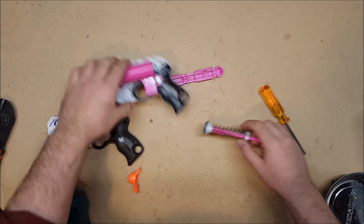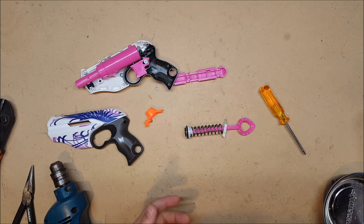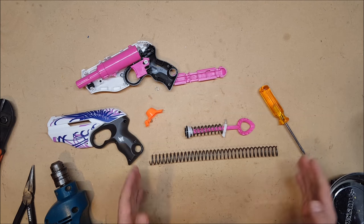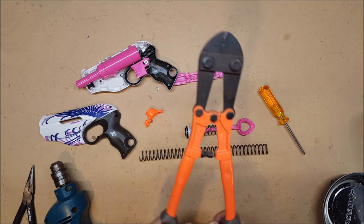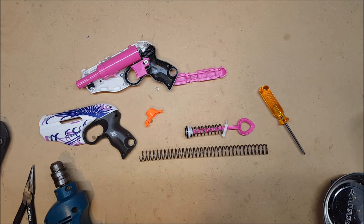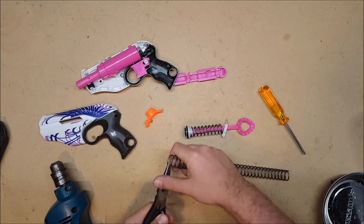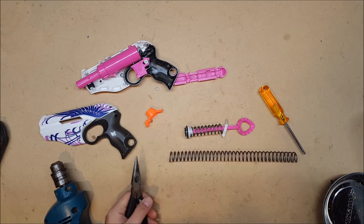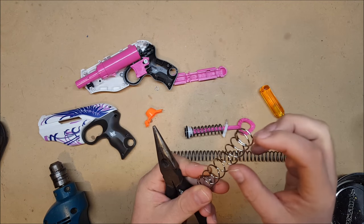In general, the amount of K26 spring you're going to need is going to be the same as the original spring. K26, or at least the stuff that I've been getting, comes in an 11 inch section, and you're going to need something fairly stout to cut it — either a cutoff wheel on a Dremel. I've been using my bolt cutters, and they work very nicely. I like to bend the very tip in so you have a more even press, like most springs. Most springs, the very end is curled so that you get a flat uniform push.